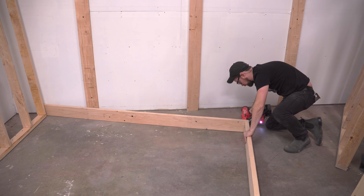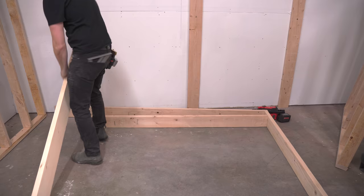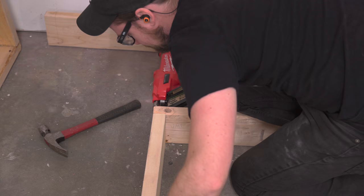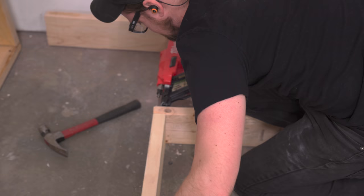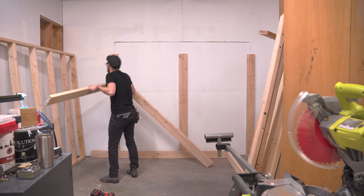With the right size two by six I can start nailing things together. These are called joists — all the parts that make up the ceiling slash floor. The ones that go against the wall are the rim joists, which support all of the floor joists, and then the end joist is what goes on the end. I have to nail on the end joist first because I can't get a nail gun in behind it once it's up and connected to the wall.